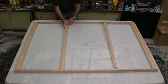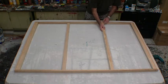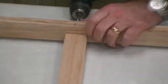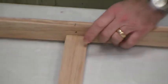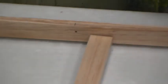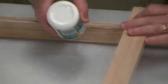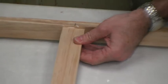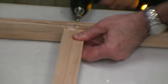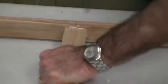That way you have the same length of timbers on all four. Now we're going to attach the center rails — same process as before. Put our drill pilot straight through, allowing for the 7mm drop down from the top of the rail. Apply some glue onto both edges so we get a good strong grip. Then with our screws we just drill through and screw them in nice and tight — you'll know they're tight because the glue will squeeze out.